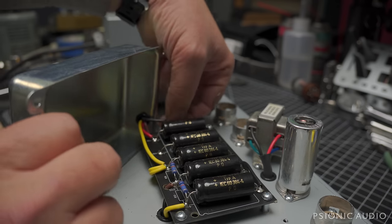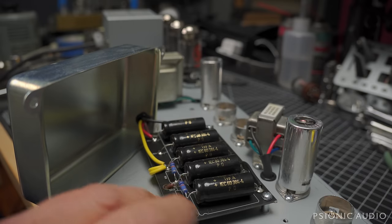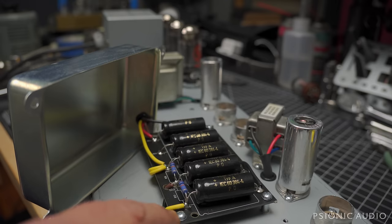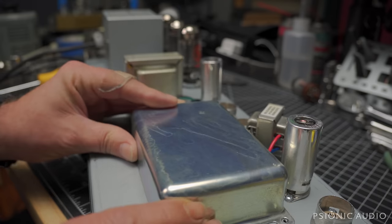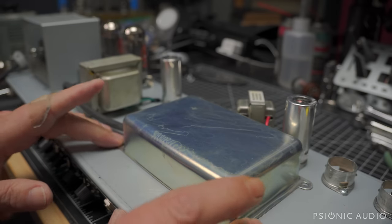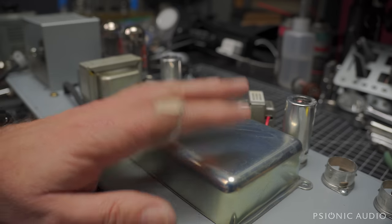They've divided the grounds into the reservoir ground here and the preamp grounds, which takes care of the phase inverter and the two preamp nodes. So all this is done very comparably to what you'd find in an actual 64, 65 Deluxe Reverb. So that part's good. We can leave that alone, and I'll screw this back in before I flip it over. I doubt that we have a problem with one of these caps. It's possible, but it's unlikely. And I'm glad to see that they're using F and T's in these.